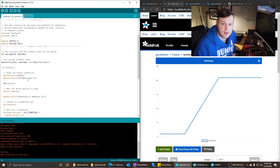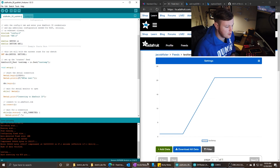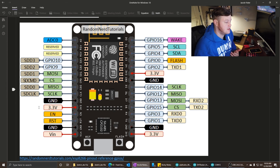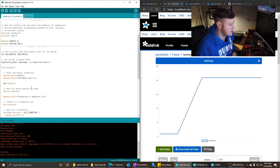That's the easiest way to get it working that I was able to figure out, using the ESP8266 NodeMCU board. Here's the pinout — grab a screenshot if you need to, or just Google 'ESP8266 pinout'. I use the ground and 3.3 volt pin to power it, and the D5 GPIO 14 pin for data. If for some reason a pin doesn't work, just try a different pin, make sure everything is plugged in correctly and you should be good. Do something kind for someone today and I'll see you next time.